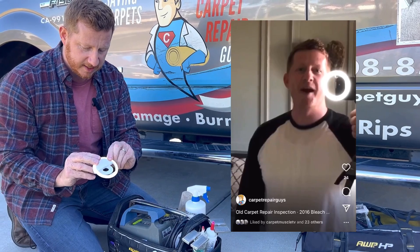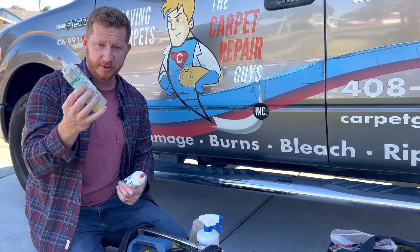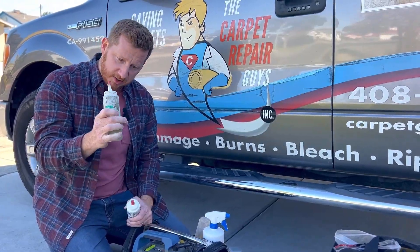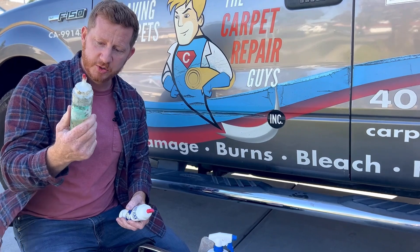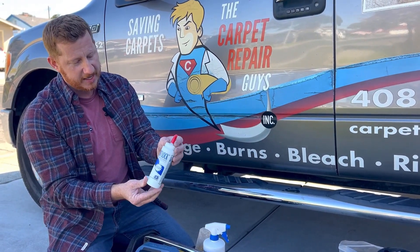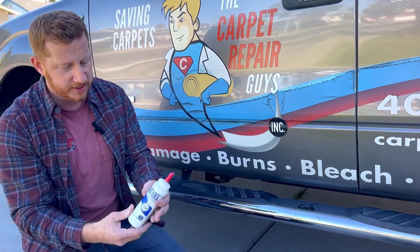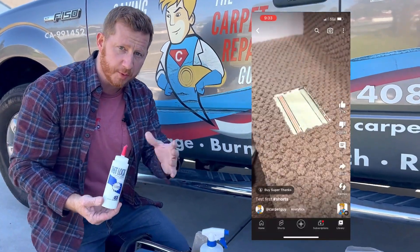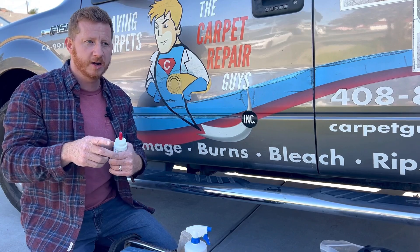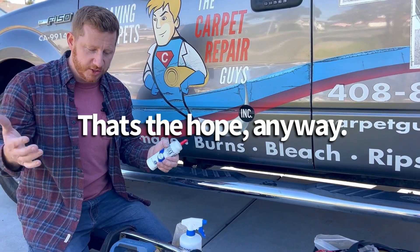Here's one of these little lights you can use. Parabon M363 — this is a seam sealer. Glue tack strip to concrete, patch little plugs, and you can glue the backing in place. And then I have a fast lock latex — this is a white glue that dries clear. You can use this especially on any of your Berber loop carpets so those individual rows and tufts aren't likely to unravel or come apart with time and use.